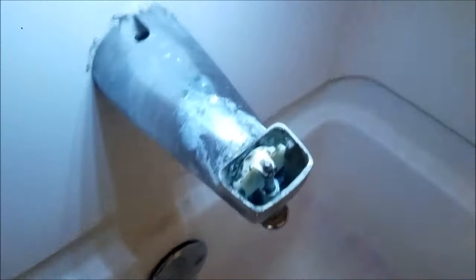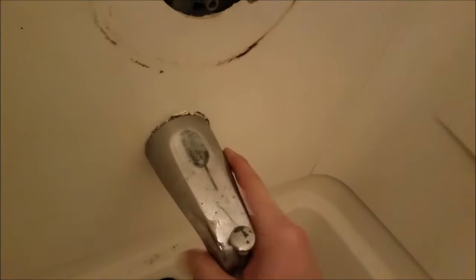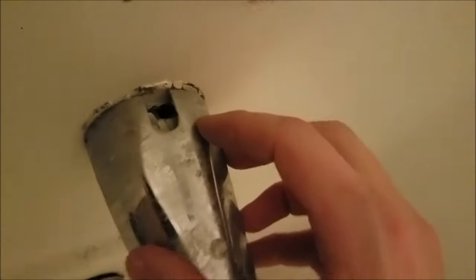And here's one of the examples of why I'm replacing this — pretty filthy. And of course beforehand you need to cut the caulking around here if it's sealed up. But here with it upside down we'll hopefully get a better understanding of what's going on. There's no set screw, and you can spin this spout all day without it really doing anything. It's not backing off, it's not doing anything. And you don't want to be ripping this thing off tugging it because you can and will damage the copper piping behind here.